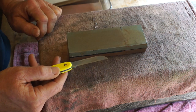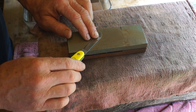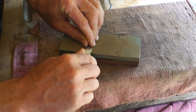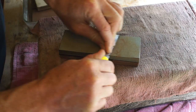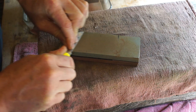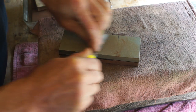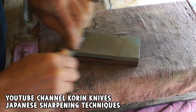There are many ways to make the grind — you have to keep it consistent and choose the right bevel angle, but once you do that there are lots of different ways. If someone tries to tell you the one proper way, just laugh at them. I like this method a lot: I skim on the forward stroke, then apply pressure on the pull stroke with my fingers right up on the edge pressing down, which makes it cut much faster. It's a very efficient, very controlled method I learned from a YouTube channel — I'll try to link that in the description.